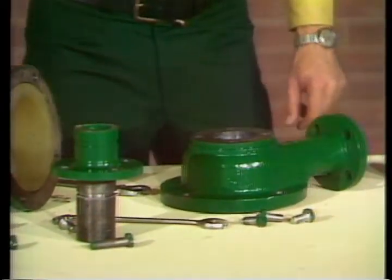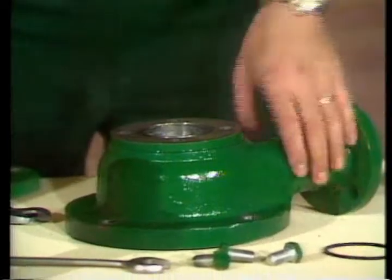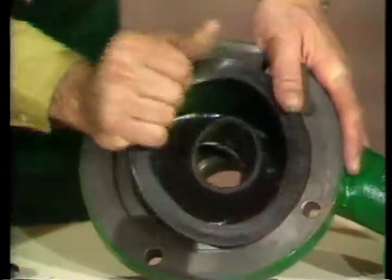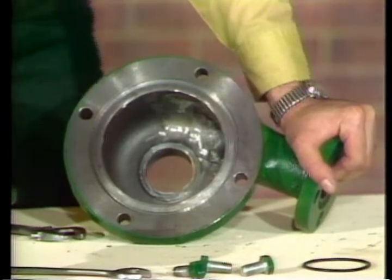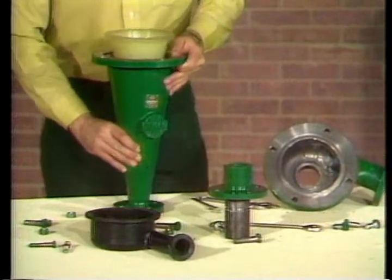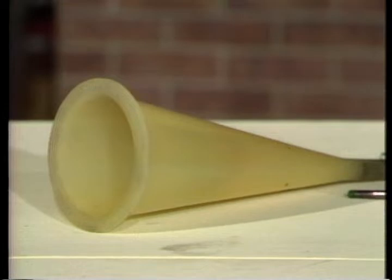And that's it. The inlet O-ring seal should be inspected and replaced if necessary, as well as the inlet liner and the cone liner itself. Demco liners are available in rugged urethane, which lasts up to five times longer than competitors' Buna-N liners.